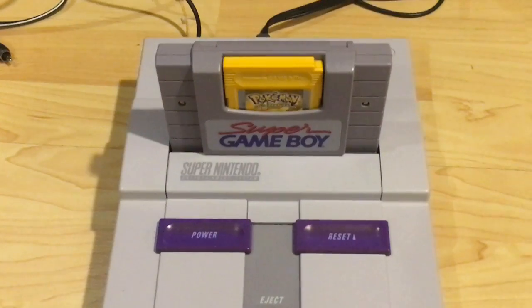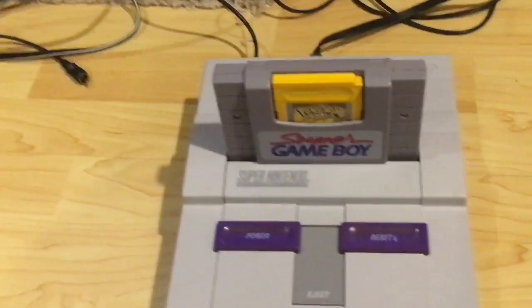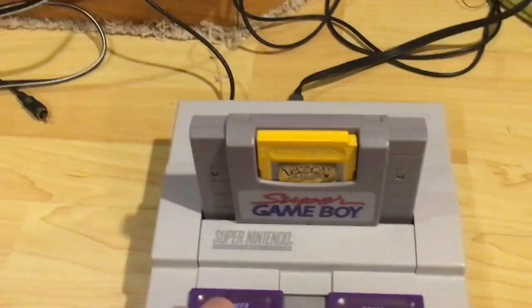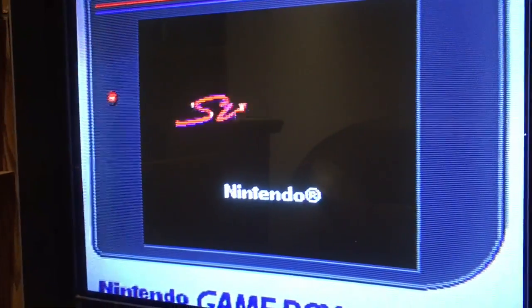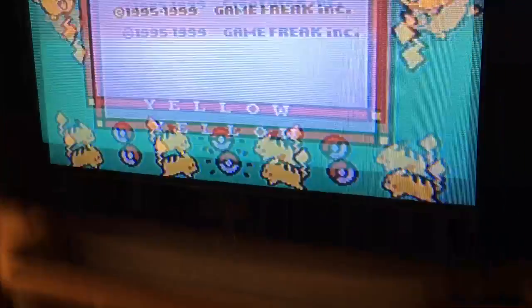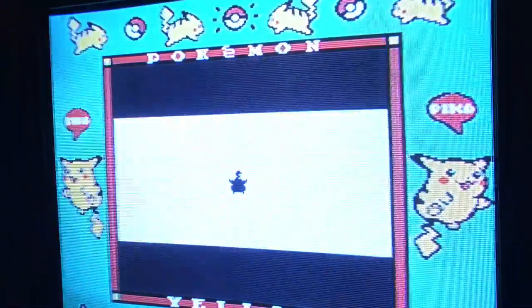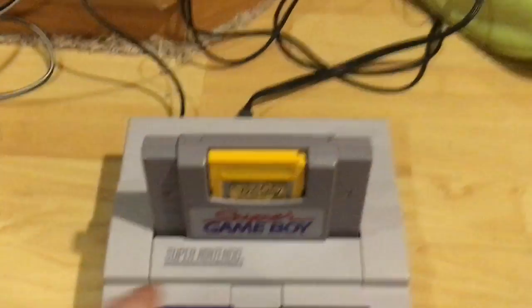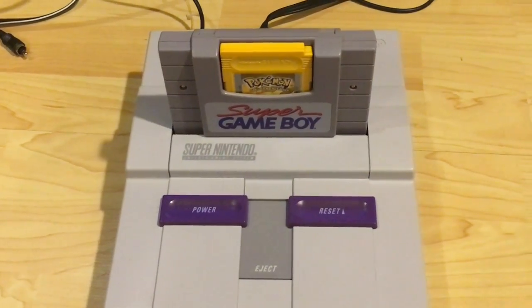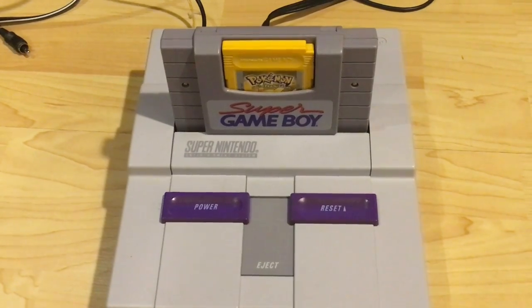I've reflowed that chip and it's cooled. This time I haven't wiped the contacts with alcohol, so it should be dry. I suspected I might need to add a little more solder on a couple of pins, but let's see — powering on — and we're in action! It looks like we've successfully repaired this copy of Pokemon Yellow. I'll screw it back together and it's good to go. Thanks for watching — I hope this helps someone out there with a similar Game Boy cartridge issue. Be sure to like and subscribe so you can see me attempt to fix more stuff. Thanks, YouTube!